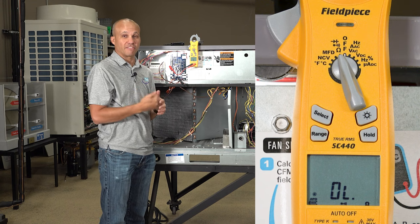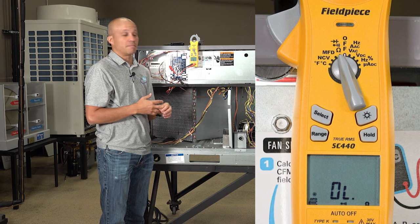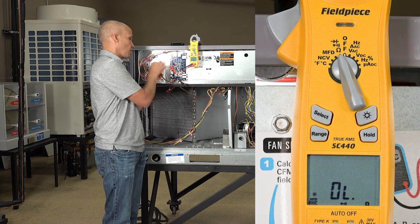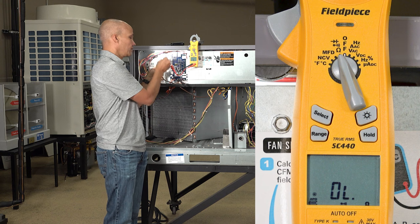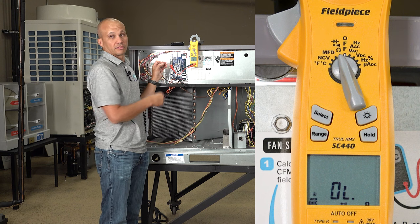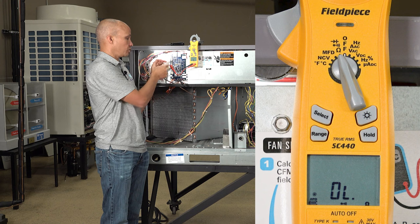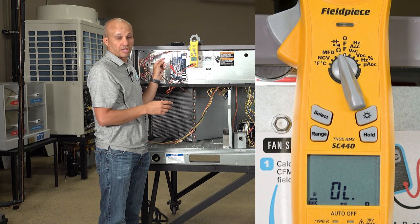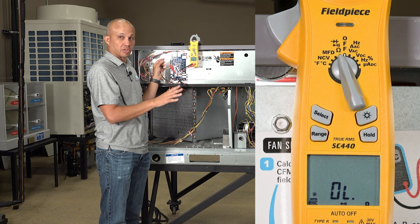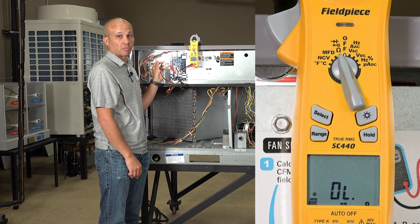So I need to either find and fix that problem or get rid of that yellow wire. In many cases you'll have extra spare wires that were not used. In this case I'm using five wires but it's an eight-wire cable. I would simply switch it — remove the yellow wire and switch to, say for example, orange or blue. Blue would make more sense. Switch to blue, and downstairs at the thermostat remove the yellow wire and switch to blue. Now blue is doing the cooling Y1 job. That's how you can figure out which of your wires might be broken somewhere.